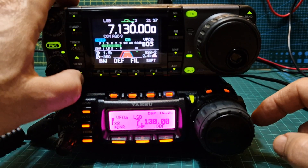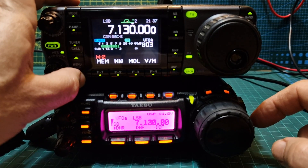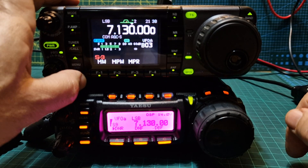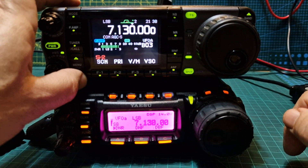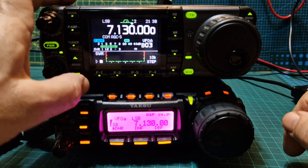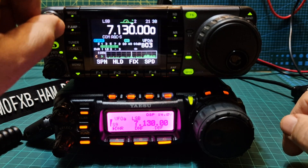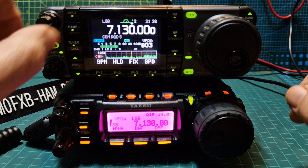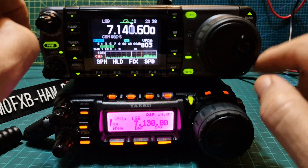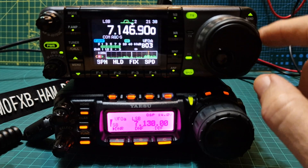On the ICOM 7000, the VFO memory - you have your menus at the bottom, push the green button: M1, M2, there's your VFO memory. M3, M1, and then you hold it. You get your S menus, go through them, hold it again, you get your meters. There's even a scope, SWR graph. There's your scope - it does jump, but you can hold it, and then you can move and find those peaks.